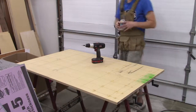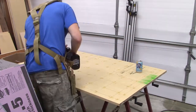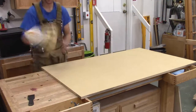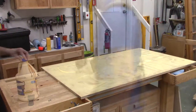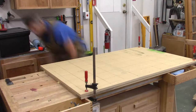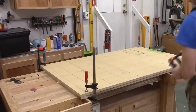Next up, after clamping the cabinet, it was time to get ready to laminate the top. I'm putting in a bunch of screws to use as clamps to hold the two MDF pieces together — definitely needed a beer after that glue-up. There are 77 holes altogether, six inches on center. Applying a liberal amount of glue, spreading it out, then bringing the second piece on top. I'm roughly clamping it in place and applying a little pressure in the middle with a jig to get the glue to squeeze out and even out.